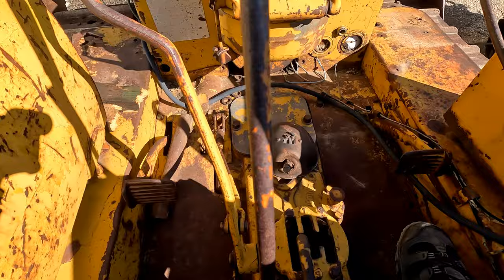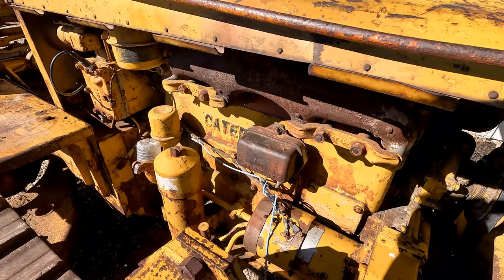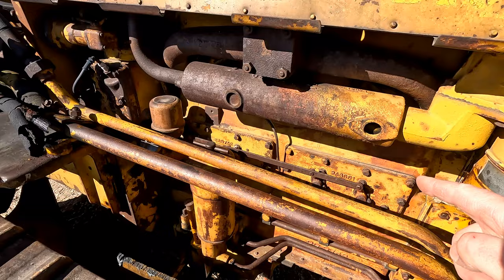The hood has a few minor dings and dimples in it, but overall not in terrible shape. And love the old generator and the Bosch regulator up there above. Something that I noticed on these later model tractors is the embossed raised logo on the side of the engine block that says Caterpillar. Now, that was something that was present on the earlier D2's, but not on the earlier D4's, which is kind of a dead giveaway that you have a D4400 engine like the one on this 5T.